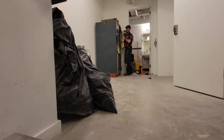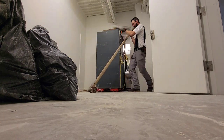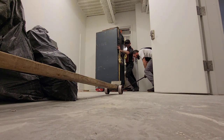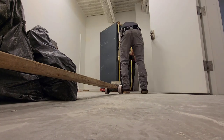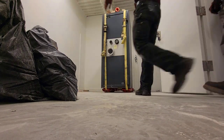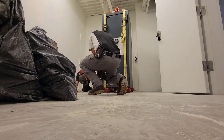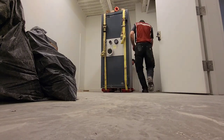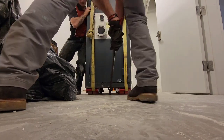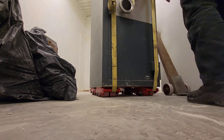Let's see how she rides. I took the swivels off of the skates because I didn't want them to move independently, and I wanted a way to strap the skates to the safe. It would be catastrophic with a safe this top-heavy. The main problem with a safe this large is that it's very tall with not a very wide footprint — so it's extremely heavy and extremely top-heavy. You can only go two inches at a time; if you go more than two inches, you chance tipping the safe over, which would be a nightmare. You'd need major equipment to reset it. In order to strap the safe to the skates and dollies, they have to remain in one direction, and that swivel would not work.